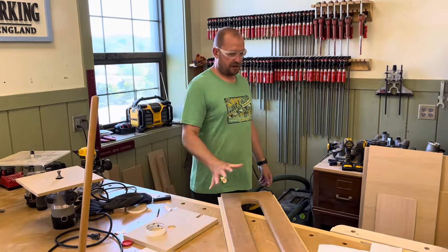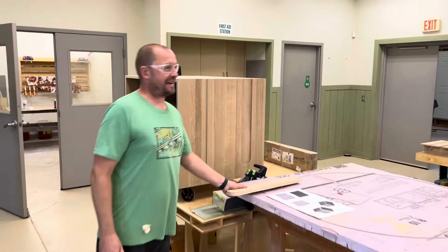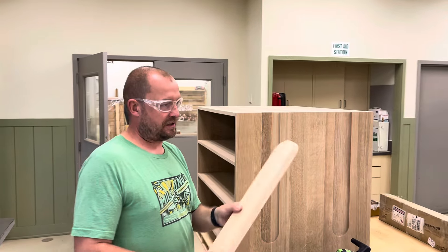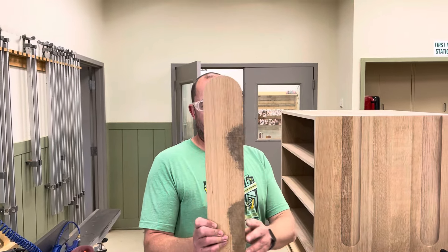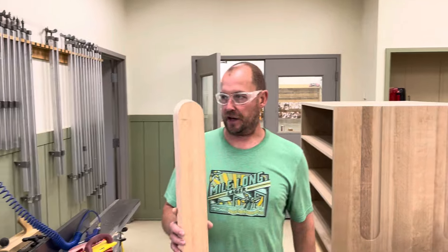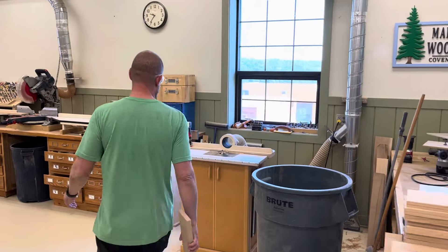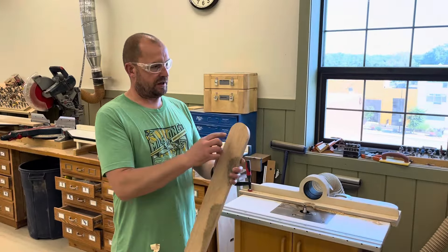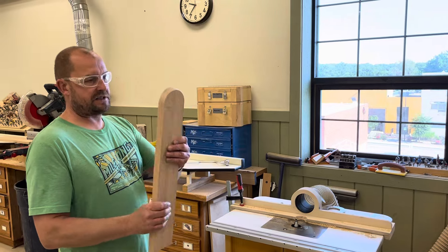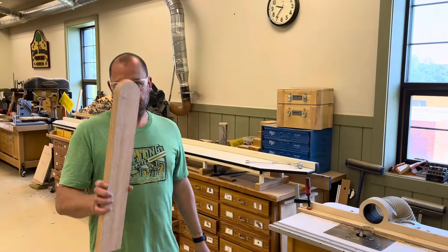To create the other piece that goes in the dovetail recess, that was done on the table saw with the blade tilted at the same angle as the dovetail bit, which is 14 degrees. For the top part, a taper bit also at 14 degrees was used with a small template for the bearing guide, creating the needed shape. Again, this was the test piece to see how well it slid up and down.